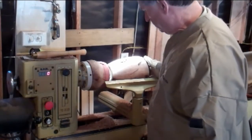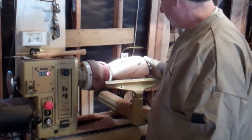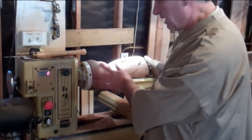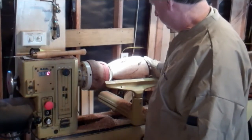I'm going to go ahead and spray lacquer. And what I usually do is, after it's ready, I go ahead and start spraying lacquer. I'm pretty much through with this here. I cut it off, sand the bottom down where it's smooth on the bottom, and generally my choice is using lacquer. I use a spray lacquer. I spray multiple coats on it, sand it down smooth, spray more. That gives you a glass finish.